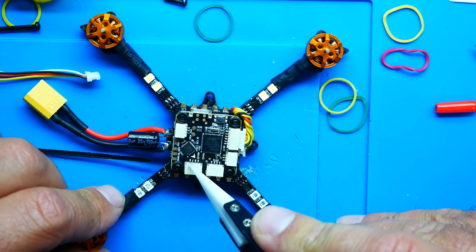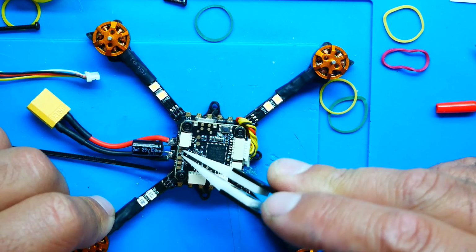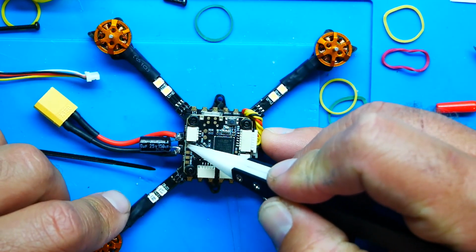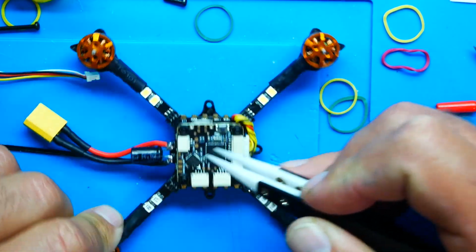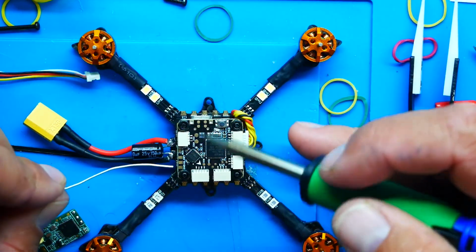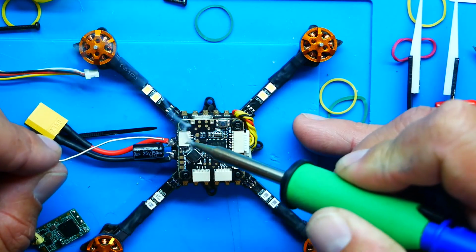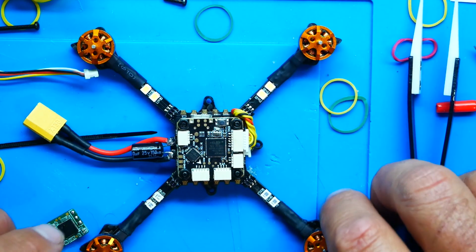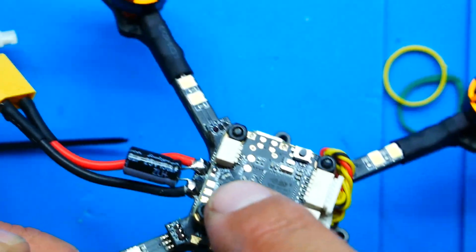We've also got a jumper. Good thing I looked, because if I didn't, I probably wouldn't know. So we'll go ahead and jump this pad. We'll use the center and the S bus, boom, boom, and then we would be ready. So make sure you do that. If you weren't going to, make sure you do. So I'll tag right there, boom. All right, so that's how you jump your S bus pad, just like that. If you didn't see that, let me zoom in on it. And it's that little bubble right there.